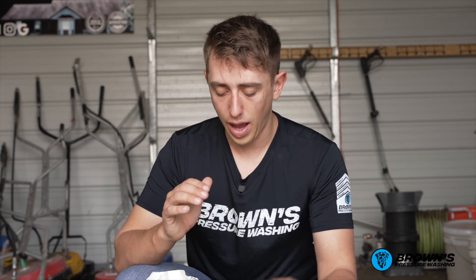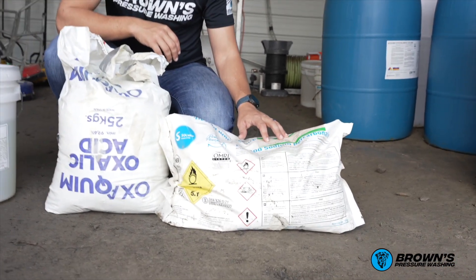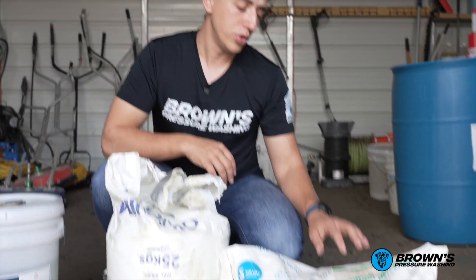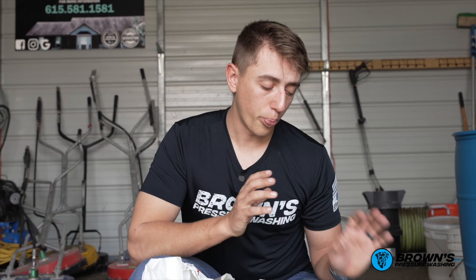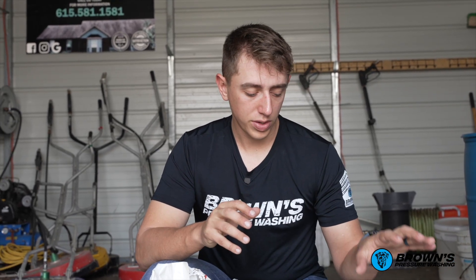That is exactly how we clean wood. Now there's another solution: sodium percarbonate. This is a good substitute for sodium hypochlorite if you don't want to use it. It will help preserve the wood a little bit better, but it's a lot harder to use, a lot more in depth, and it doesn't make the wood look as bright and as young as it once did. It will clean it, but it'll still have that weathered look.